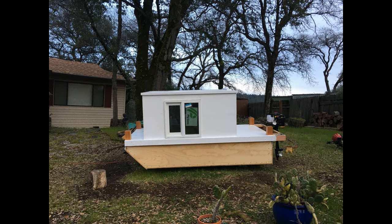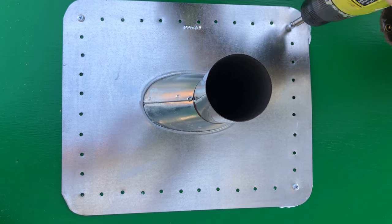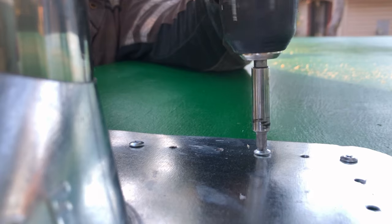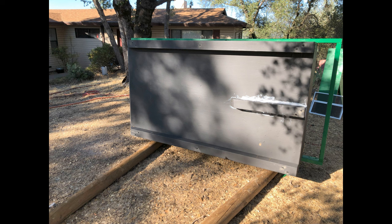I put the windows in and splashed some paint on it. I also like how this eyebrow around the top of the house provides some definition to the form. Next I installed the wood stove. When I put this penetration through the top of the house, I applied lots of silicone to provide a good seal and then siliconed around each screw. I thought it looked really sharp with the green and white. I plan to operate this boat in some very shallow waters, so I added 4x4 skis to the bottom so that when I touch bottom, I'm going to touch the skis before I damage the bottom of the boat.